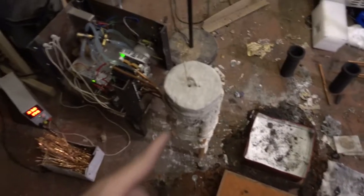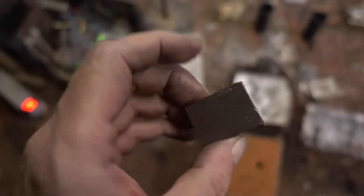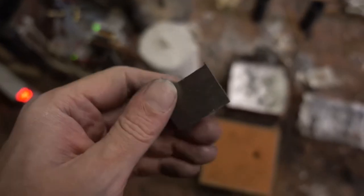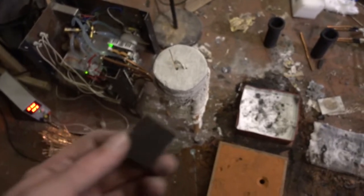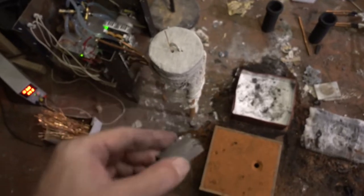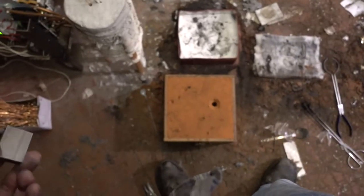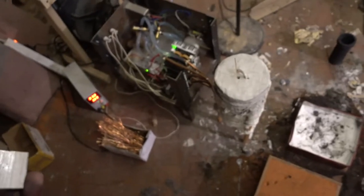Okay, I have some copper in there. The rest is there, and 40 grams of titanium. It's actually 42, but close enough. And I will repeat the procedure from last time. I will preheat that and plunge it into the liquid copper. And then I will cast this mold, and hopefully I get an axe head.